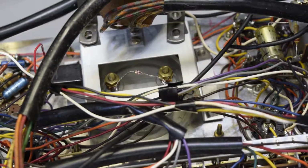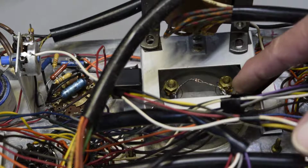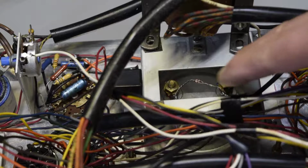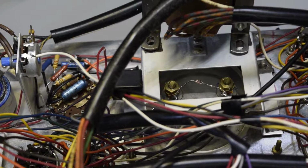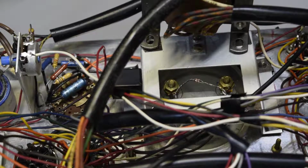you solder it to your meter right there. And it doesn't matter polarity because you got them crossing each other, so there's no polarity. So it don't matter which way it goes in. Just one goes on the positive and one goes on the negative. And that'll protect your meter from overvoltage, so you don't burn the meter movement out.